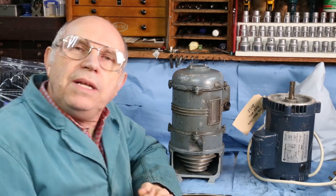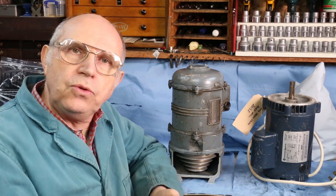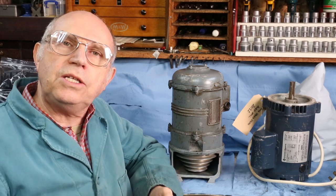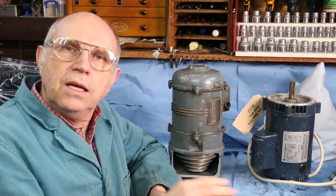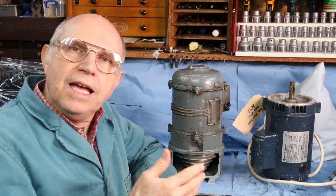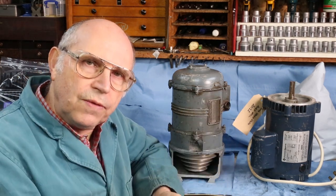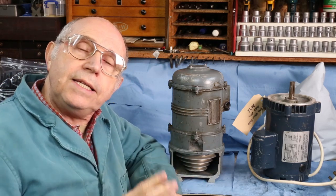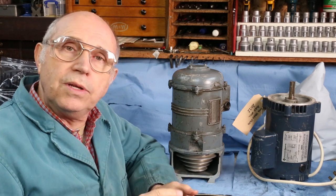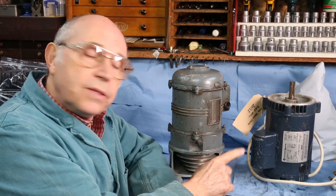Hello everyone. My milling machine is an Alexander Master Toolmaker milling machine. The nice thing about this milling machine is there are lots of accessories available to fit onto it. I need to do a job where I need a high-speed vertical head. The vertical head that's on the machine at the moment is powered by a motor within the milling machine itself. This other head, the high-speed head, doesn't use that motor — it uses its own standalone motor. In fact it sits on top of the head. The previous owner didn't have any three-phase power available in his workshop, so he fitted a single-phase motor to the head.